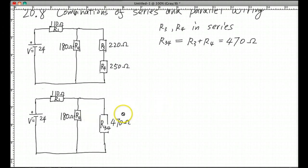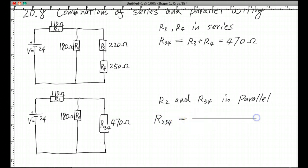Now if you look at the new circuit, you can call it simplified or equivalent. Look at R2 and R3-4. What's the relation between R2 and the combined R3-4? In parallel. Then let's calculate the combined resistance of these two, and call it R2-3-4. It equals 1 over the sum of 1 over R2 plus 1 over R3-4. Like this, right? And if you calculate this,